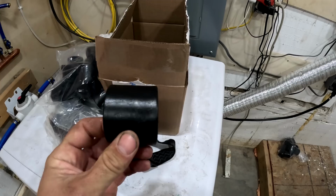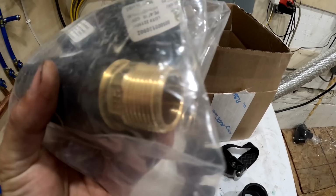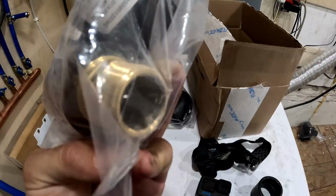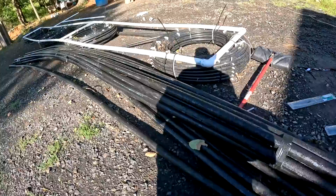So then when you come into the system, you have these adapters where it goes from the fusion pipe to a brass adapter, male threaded. So this is the pipe that we're using. It's special geothermal pipe. It's 1.5 inches. It's pretty thick wall, like 3/16 thick. It's pretty durable stuff. We're letting it sit out in the sun right now because we need to take two of these and bend them for around that corner,